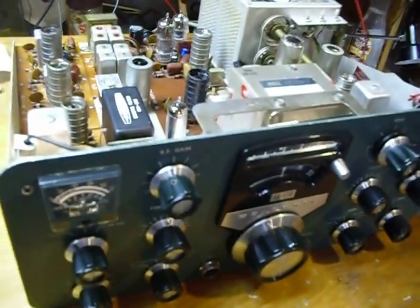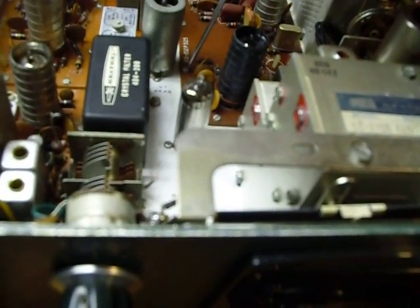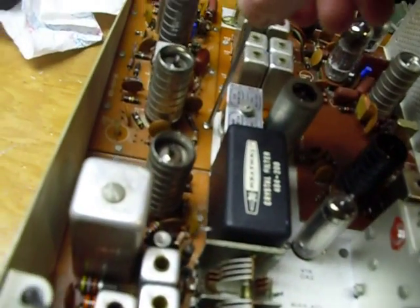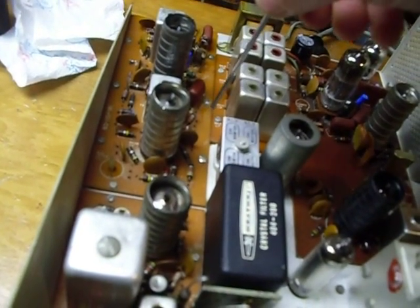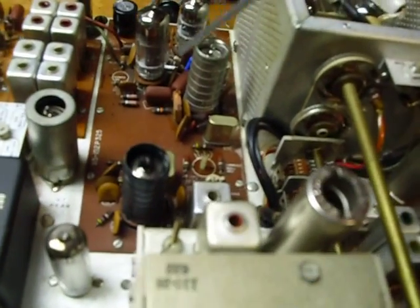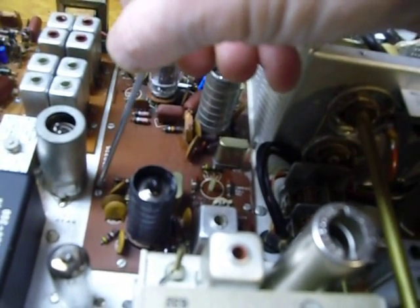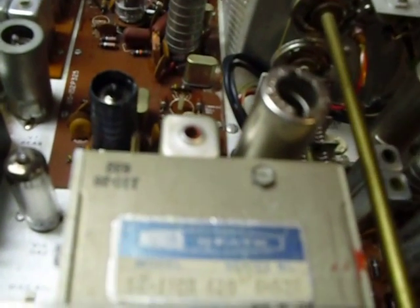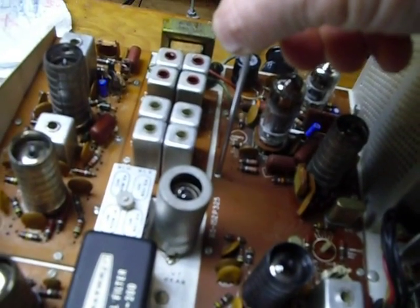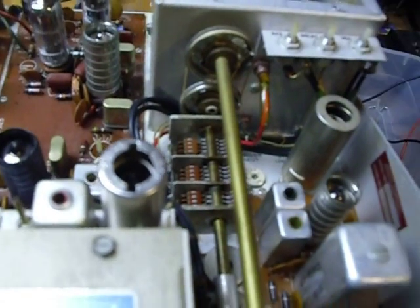Something very important with the Heathkit final assembly: before you do any further testing, be sure you come in and tighten each and every one of the little screws on the circuit boards. Get yourself a nice screwdriver that fits well and tighten all of these screws. These are the grounds for the circuit boards — very important. The circuit boards are made of a Bakelite material and they will compress, so screws work loose. They should have lock washers on the bottom. If you reach one you can't tighten, go underneath and hold it with long-nose pliers.